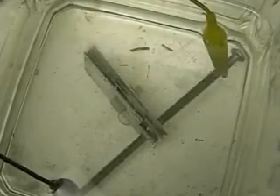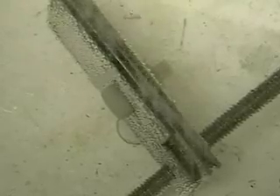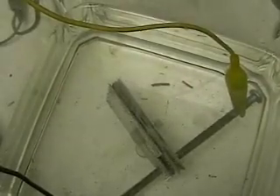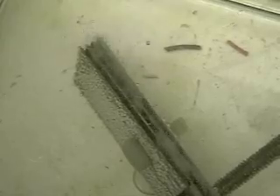I'm not going to change the water and we're not going to change the plates — we're only going to change the position of the electrodes. At this point it doesn't matter whether the electrode is positive or negative. There are two neutral plates in the center, and the activated electrodes are on the left and right side. The right side is negative, the left side is positive. It does not matter.